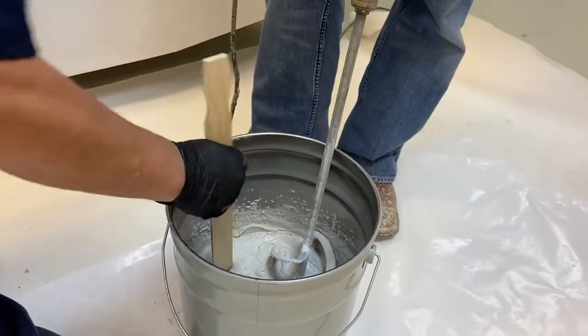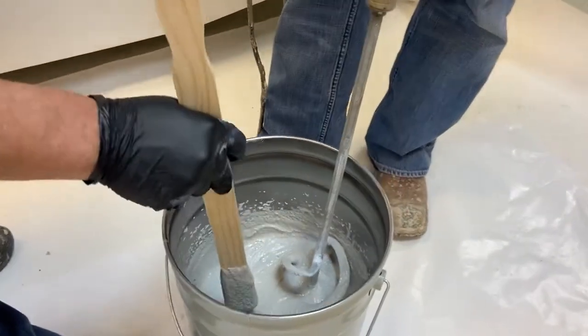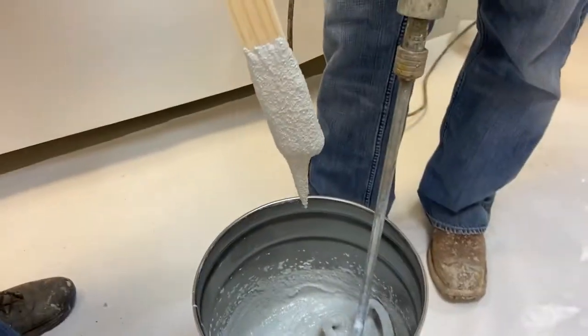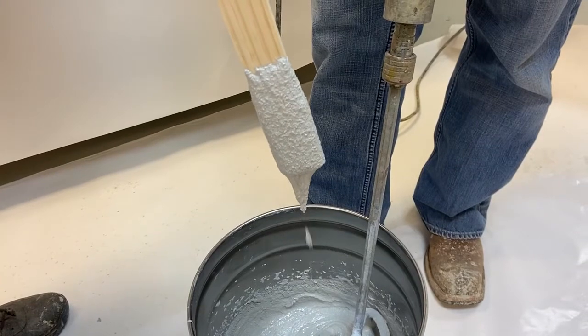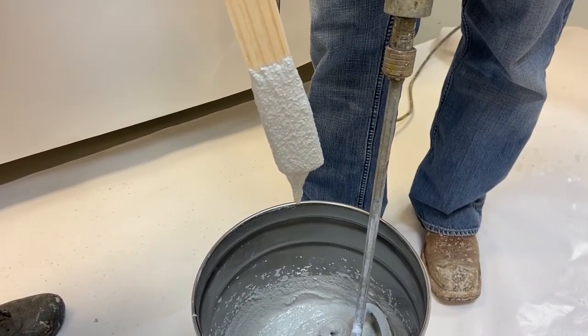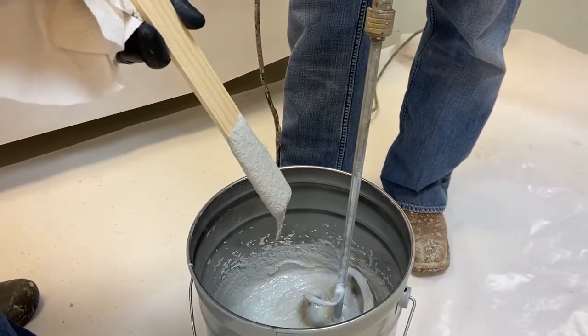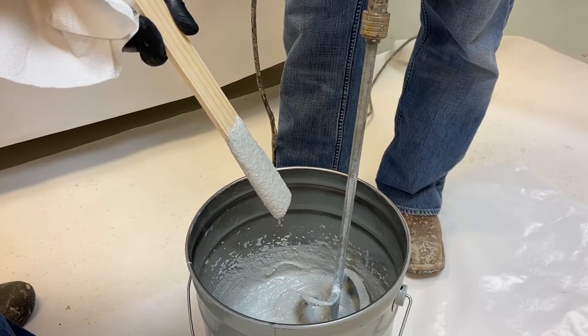You're not going to be able to hang on a vertical unless the mixed material is able to hang on a stir stick. You basically just want to wet your stick and come straight out to see whether or not your mixed material will hang. We're seeing some of the initial material, which was probably at about a half an inch, slough off of the stir stick.